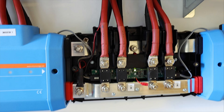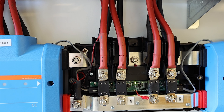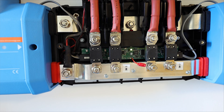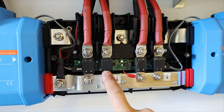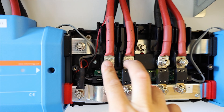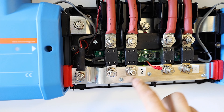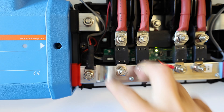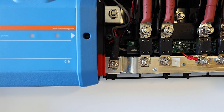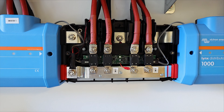As you can see, I have two positive cables going directly to the inverter. I decided to use two separate cables for one reason: heat. If I used one thick cable — for example 95 mm² — with only one fuse, I would have a bigger fuse and a very hot area because everything is drained from only one point. With two separate cables of the same size, the heat is dissipated over two points instead of one. To be sure the temperature is correct, I placed a temperature sensor here — a wire sensor connected to my GX unit — and all the information is broadcast to my phone or mobile app.